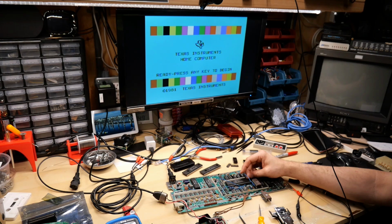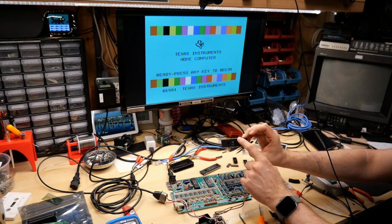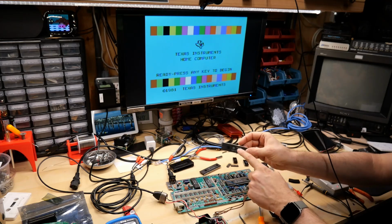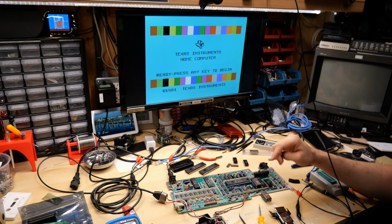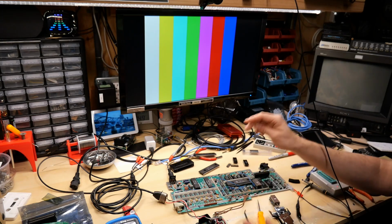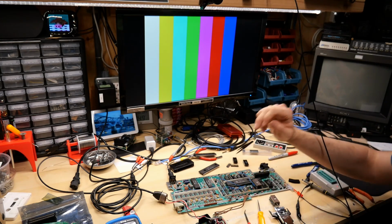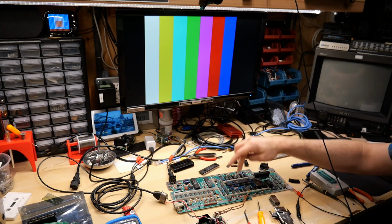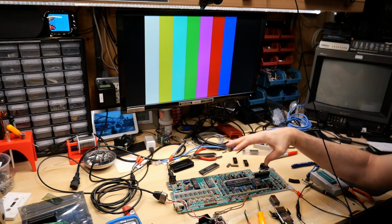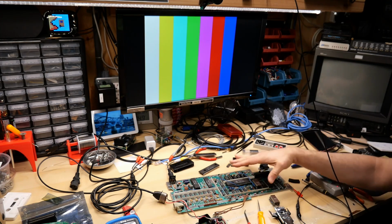Wow. Just wow. So I can hear people asking right now, this is the original CPU that was in this machine. Does this CPU work? Was it the ROM the whole time? Before I turn this on, I am 99.99999, so many percent, sure that this CPU is actually dead and was the only problem with this board originally, before I killed the ROM and I killed the 373 with 12 volts.